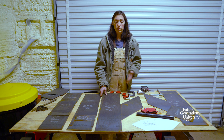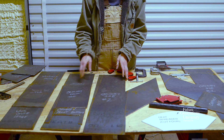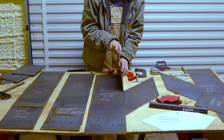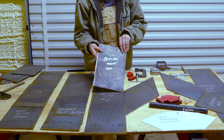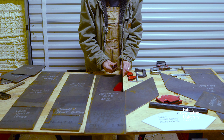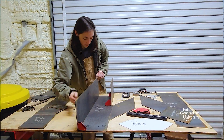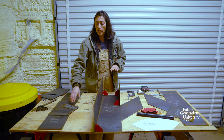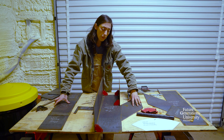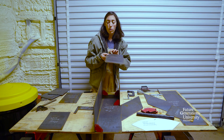If you're working with sheet steel, you'll start by cutting out all your pieces — we've gone ahead and done that. I'm going to begin with one of my chimney sides as the bottom piece and weld to that to get my 8-inch square chimney. I'll use my chimney front top, get it set up with magnets to make sure our tacks are 90 degrees, and do the back the same way. Once tacked, I'll add my chimney front bottom, which has the ash pan cut out, as well as the wood box frames, wood box top, and wood box bottom.